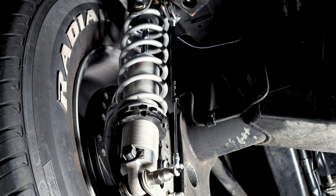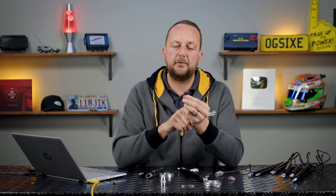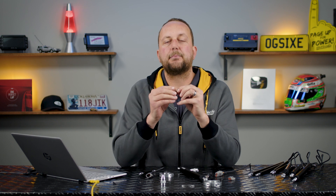One of the interesting things is that this screw is plastic. Don't think we've packaged the wrong thing — it's plastic on purpose because it's a sacrificial part. If the linear position sensor is mounted somewhere where it might bottom out, instead of smashing the sensor to pieces we'd rather this plastic part break. You can always replace it easily and it doesn't do any damage to the position sensor.